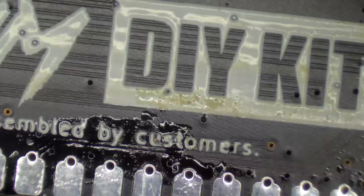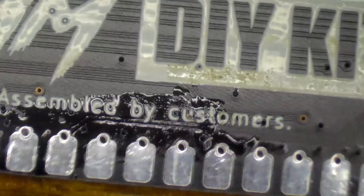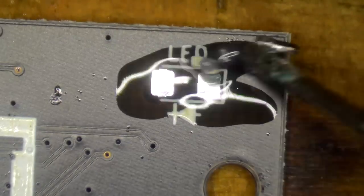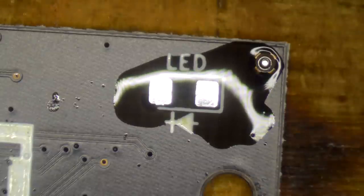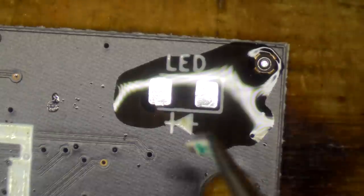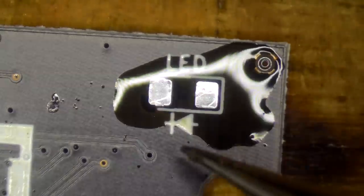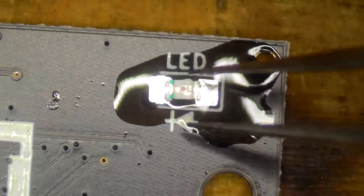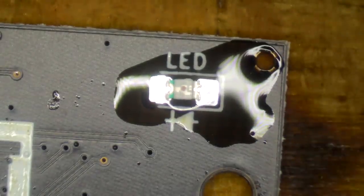While this is flat, once I put the chips on, we'll make this board sort of rocky on the other side. So, see that for this one, I'm not going to put solder on first because I'm not going to use a hot air station because my fear will be that I will melt these little LEDs. So, LEDs, as you know, are a diode. That's what the D stands for. And that means that they allow flow in only one direction, so it's very important these get put on the right way. And we can see we've got a little arrow here in a line, and this one has a little green bit on one side. The green bit needs to go onto the side with the line of that little diode symbol.